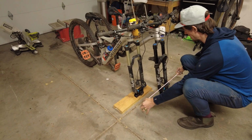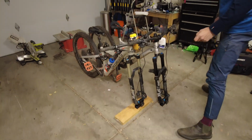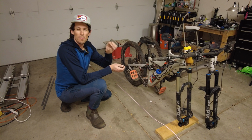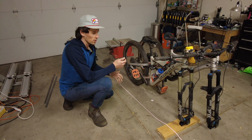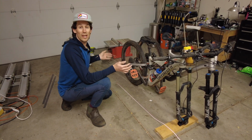So we're at about 19 inches wide, which is about what I was expecting. So the rear of the tray is going to have about a 2-inch lip to keep dirt and moisture and stuff inside the tray. It's really nice. You can just sweep it out. So I'm going to measure out about 2 inches off the ground on the rear wheels to figure out what the length of this thing is.